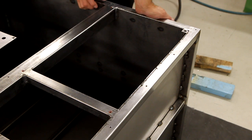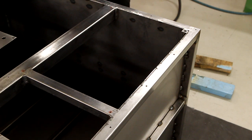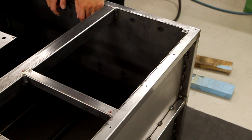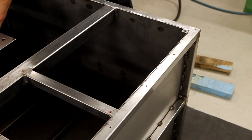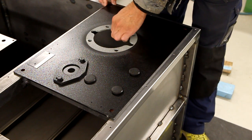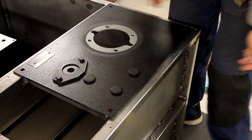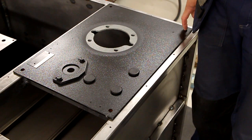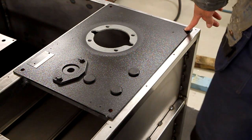Alright, that one is finished so that's okay. That one, that one, and that one needs to be bigger, and I am contemplating how I am going to do this. Because obviously I want the threaded holes that are going to be there, there, there, to put the black pipe. So there is only one millimeter clearance in each hole.